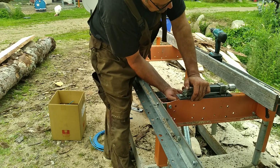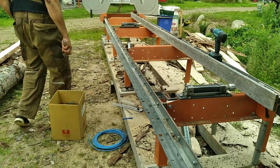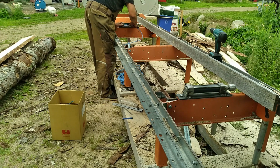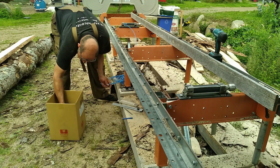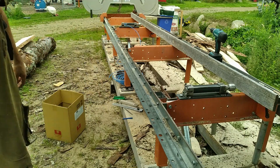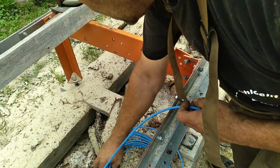We always try to waste nothing, so I like to mill the logs so that I have mostly nothing left over. And if you don't know how a band sawmill works, in case you want to cut the board so that nothing is left over, you have to put them upright to cut some live edges off, and here you need clamps to hold the boards upright.